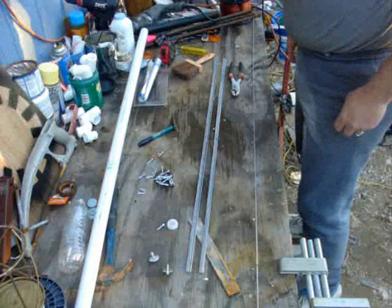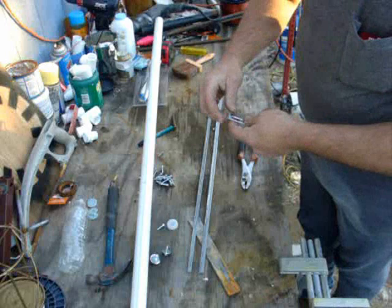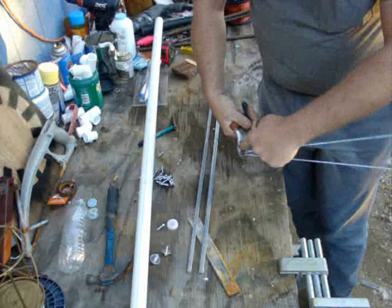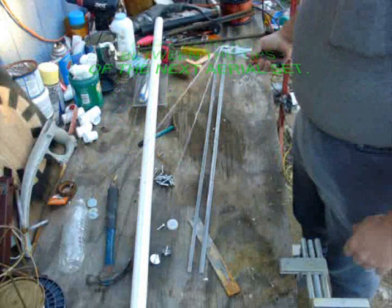That's going to do all these little marks on the PVC right here. Grab it right next to the mark — you can see a little bit of silver between the green and the mark — and squeeze them in. It's important that I want this screw to be able to go through here, and then about on the other side of the screw I want to grab this, about the width of the pliers, and bend a 90-degree angle. Get it pretty sharp. Then I want to look at the plane that the pliers are lined in and bend this out just a bit. These should be about five and a half inches apart, and after they're on here they should be about four inches from each other.